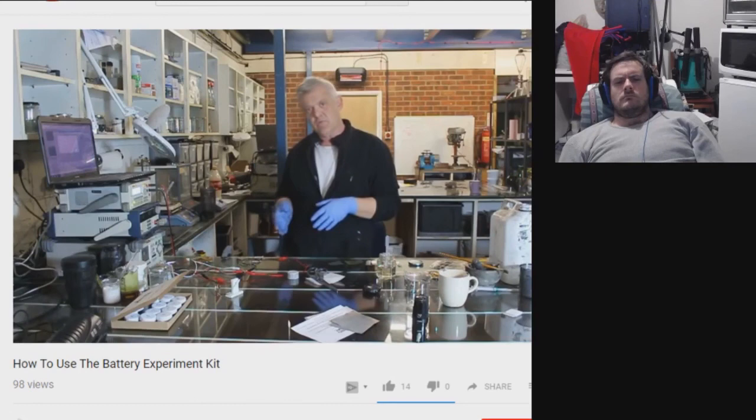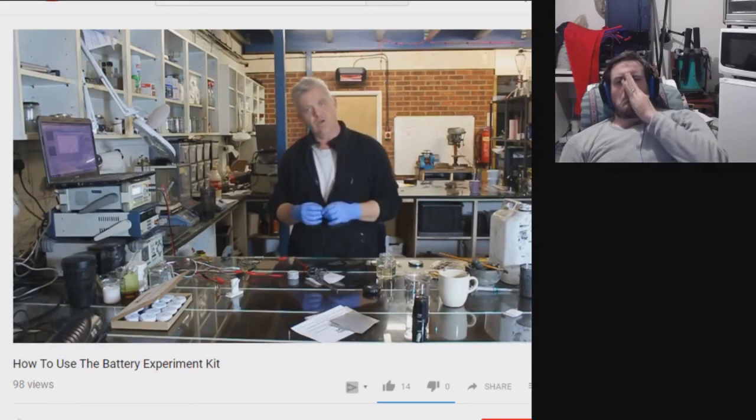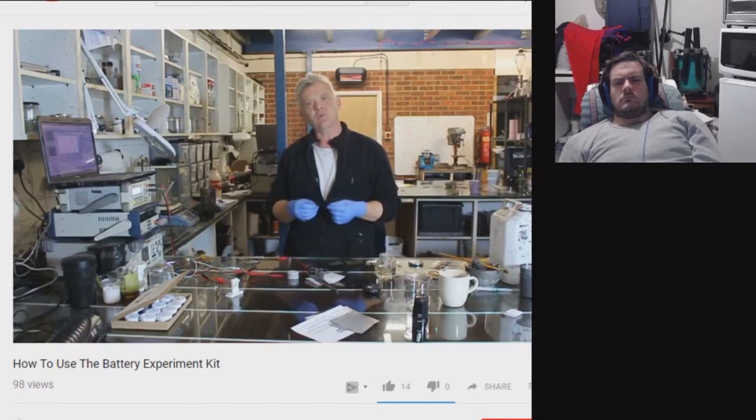If you think what a supercapacitor is, that would make sense, because a supercapacitor really is just ion separation. No reaction, really. And they go back together. When you're using metal oxide, you're using a redox reaction. Redox reaction goes in both side reactions, so there is lots of active material at the time. That has an impact on the life of the device. So a symmetric supercapacitor, you can expect to have a million cycles. When you do an asymmetric supercapacitor, where you're using a redox additive onto the actual anode or cathode, then you're going to have another effect, and that effect is going to reduce the life cycle down to something like 5 or 10,000 cycles. Bear in mind that's hundreds of years, so it doesn't matter that much, plenty to play with, but you do pay a cost for everything that you do.